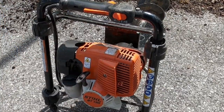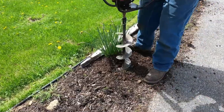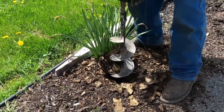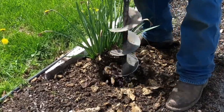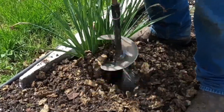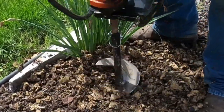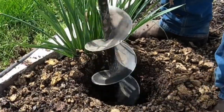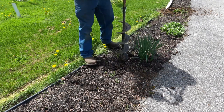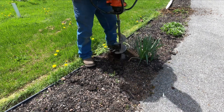So the plan is to bore each hole right beside the rotted off post and sidestep the fence about four inches, which should be relatively unnoticeable to the naked eye, or even the slightly clothed eye for that matter. If the dirt isn't too rocky, this steel post hole auger can save you a ton of work, and this dirt happens to be perfect, although the job itself is actually boring. The auger cut nearly effortlessly and the repair is a success, so I'll quickly drill the rest of the holes.